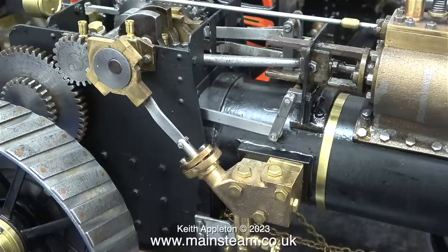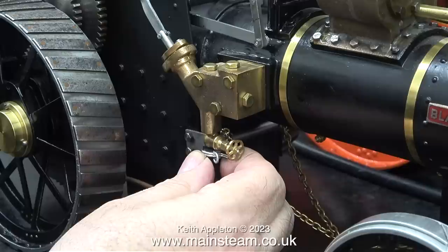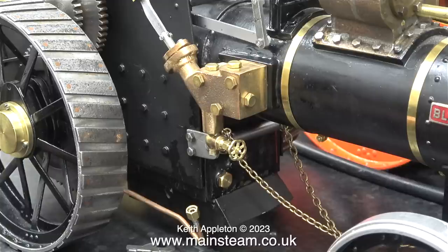This is the crankshaft-driven pump that is supposed to take water from the bunker tank and pump it into the boiler. I connected a piece of silicone rubber tubing to the water inlet and opened the valve on the compressor. Unfortunately the pump did not make the right noises. Although there was a way through from the water inlet to the ram, behind this pump block there should be a hole into the boiler — maybe that's where I can get some air in to test the engine.